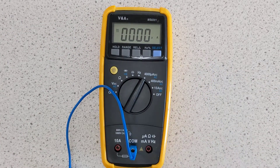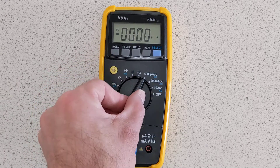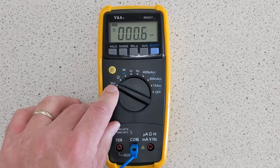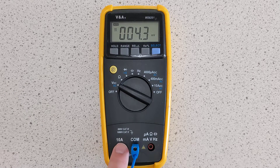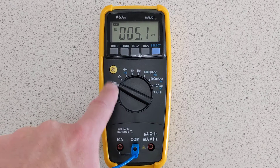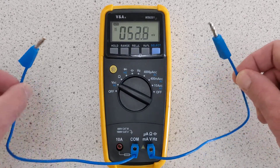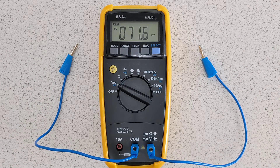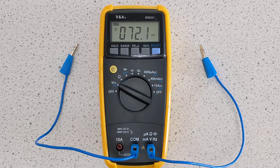So that's how you use this meter as an ammeter. What if you want to use it as a voltmeter? Well, you turn the dial to the VDC setting — that is now going to be a voltmeter. But which hole do you use? This hole says 10A — 10 amperes — which corresponds to the 10 ADC setting. The one that's got a V on it is this one — that's your V hole, so you plug your wire into that hole. That is now a voltmeter, which you can connect in parallel with whichever component you're interested in the potential difference across. This model will automatically scale the potential difference it gives you — some models will not, and I'll show you that in a moment.